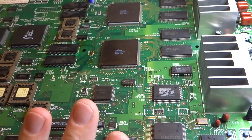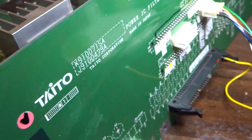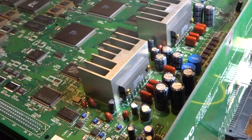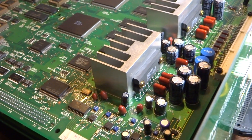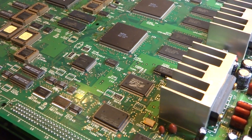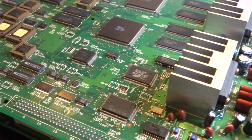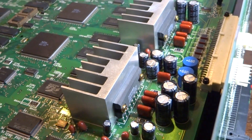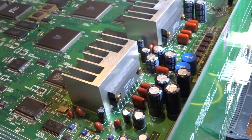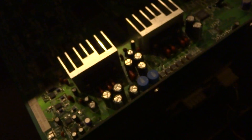This board will not work with a regular CGA to VGA converter — it doesn't sync properly. If you try to use an S-video connector through a super gun, unless you're using a CRT or tri-sync monitor, the screen will just flash. With an S-video cable you'll probably get white lines across it, similar to trying to display a 24 kHz image on a 31 kHz monitor. I tried a 24 kHz monitor and it actually synced worse. The only thing that worked was an old tri-sync CRT I use for other shooting games.